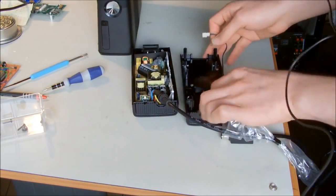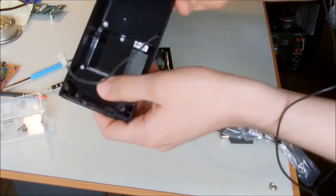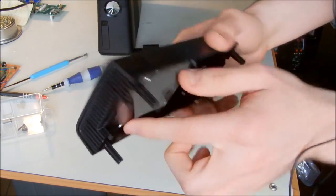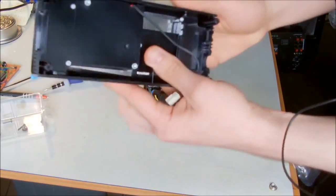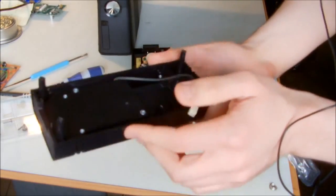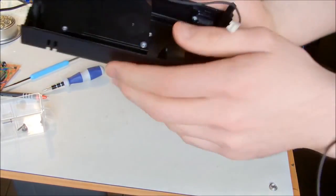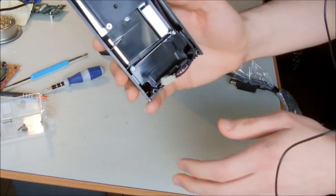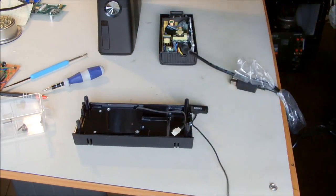And there's also a fan. I was checking on the internet, and some people say that if the fan is not spinning, maybe because it's blocked by dust or something, then it doesn't turn on. So the first thing I'm going to do is check the fan on the upper side of the power supply case, to see if it's clogged by dust or other stuff. For opening them, it's just normal Phillips screws. You're going to need your normal screwdriver. I'm going to find it. Just a moment.